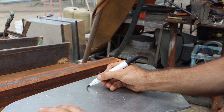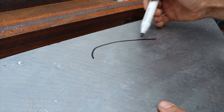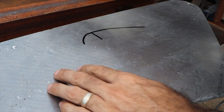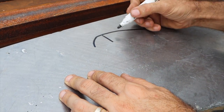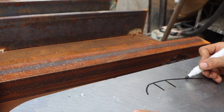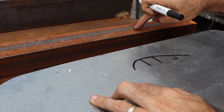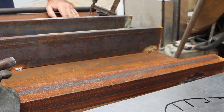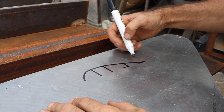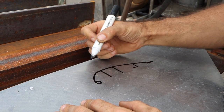We had too much curve on the 6mm steel wing. So if you imagine, it's exaggerated, but that's the wing. That's these pieces of 16mm flat over here, two of them. Then we had a right angle like so, which is this piece just here. And then we've got the 6mm by 100mm flat at the back. And that's the internal structure of the wing. Now we welded a piece of 50mm onto the front like that.